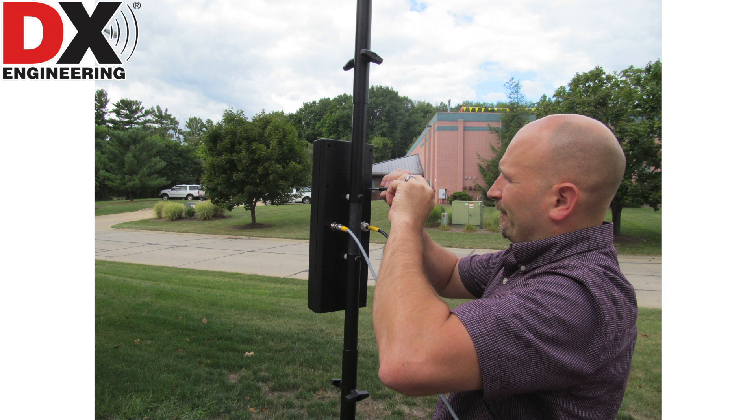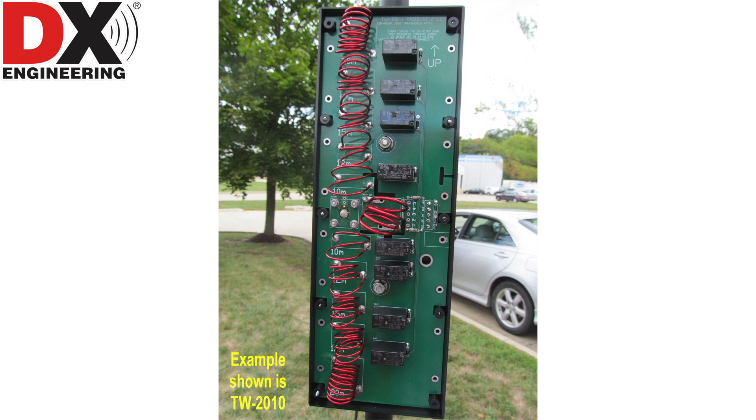The next thing you can do to lower your SWR and get that antenna to tune right is to open the box itself. There are screws that hold it together, and inside that box are several tuning coils. To lower the resonant frequency, squeeze the coils together — this creates more inductance and lowers the resonant frequency of the antenna. If you need to go up in frequency, spread the coils apart. There are coils on the top and the bottom of this box, and you should match the top with the bottom.